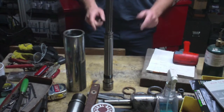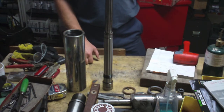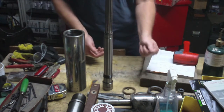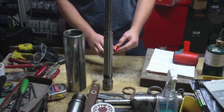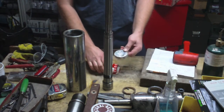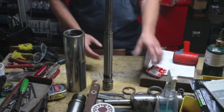It's been about a week since I procured the parts mill, got the spindle, and took everything apart and cleaned it all up. I'm going to repack the grease in the bearings this morning. This top bearing is a double-shielded bearing that I can't service, so I decided to replace it. I found a new old stock bearing on eBay — shipping was about eight bucks — and it's exactly the same type: double shielded and even the same brand, FAG. So we'll put that bearing on and get the spindle back together.